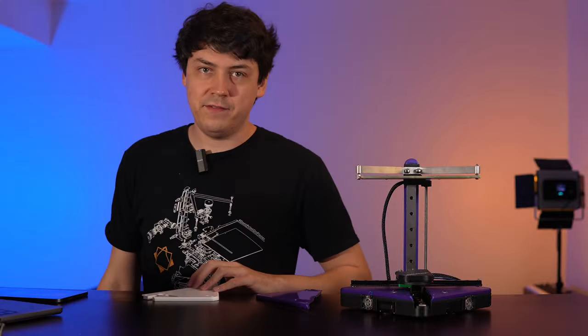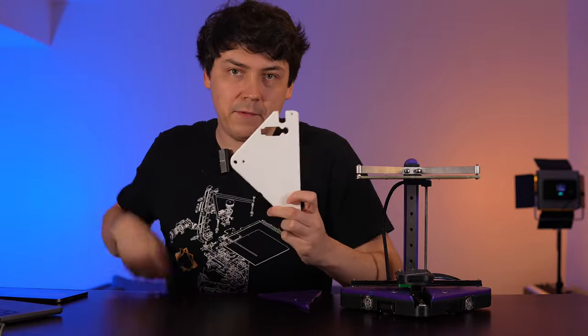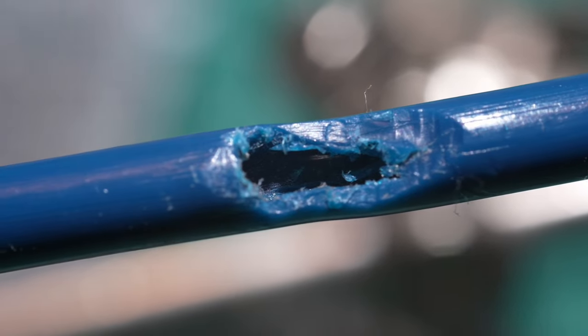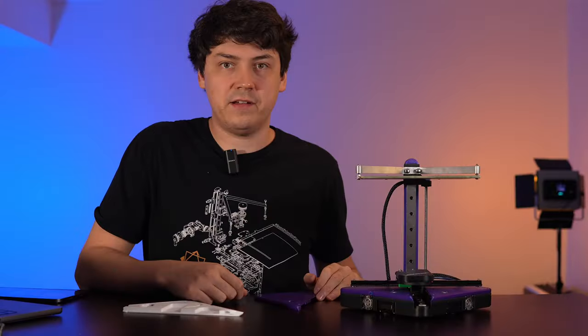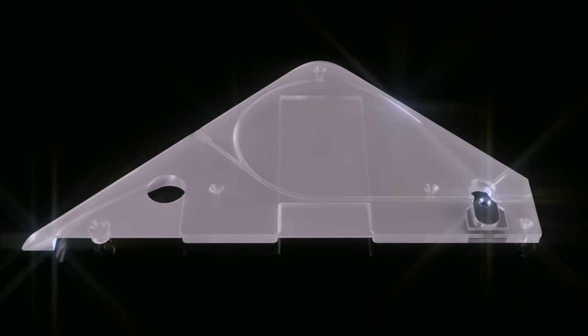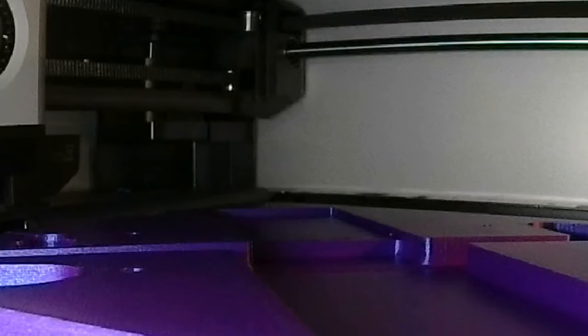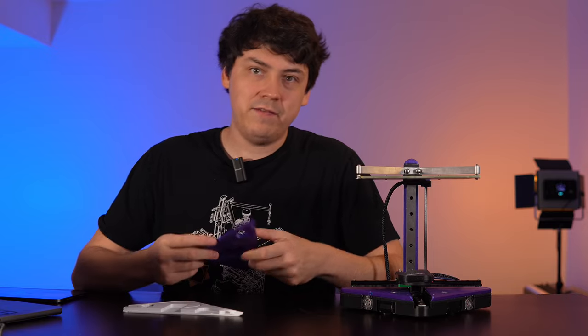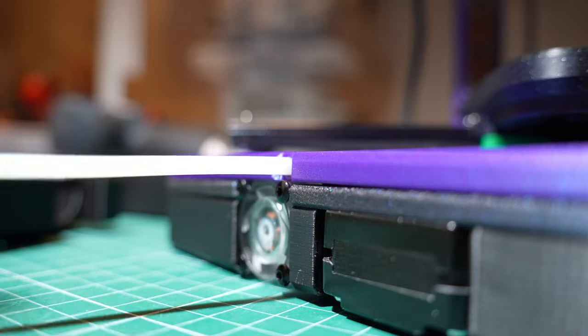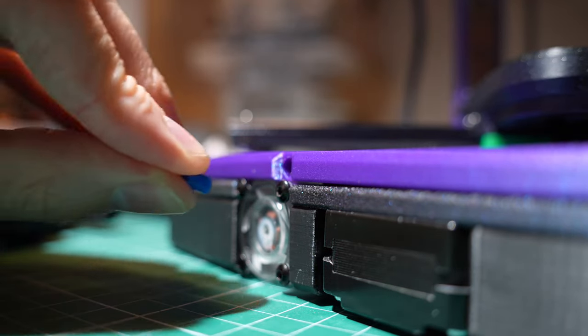The top plates have also received some work. The previous prototype required drilling into the sidewall of the Bowden tube, but in practice the hole was nasty. That's now solved with exactly what 3D printers do best — making cool meandering internal features, like an integrated filament path. I did leave 10mm of Bowden tube in the inlet, so you can have a reverse Bowden tube or simply a PTFE inlet.